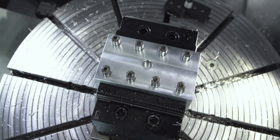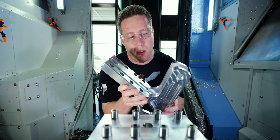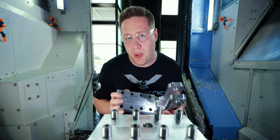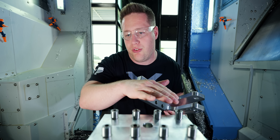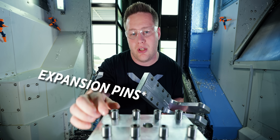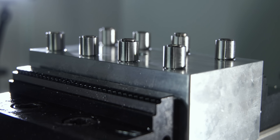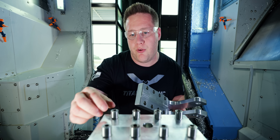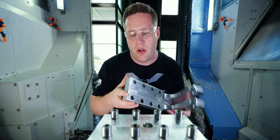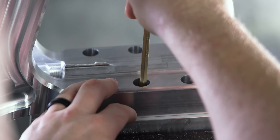If you take a look at this part we do have some vertical walls on the side, so we could technically hold this straight in our vice for Op 2 — if this was the only part we were making. But we've got to make a lot of these parts, so I don't want to have to indicate every single one every time I change the part out. That's why I decided to make a simple fixture — just a rectangle with some threaded holes in it. These 5/8 holes are perfect for the Mightybolt extensions; not only will they hold the part securely, they'll also locate it very well. Eight is probably overkill, but we've got eight holes so why not use them. If these don't locate it well enough, we could take two out and replace them with locator pins. Now all we have to do is slide this straight on, get our Allen wrench, tighten these up, and it should be good to go.